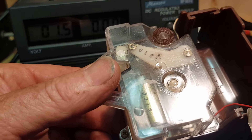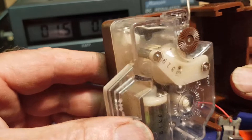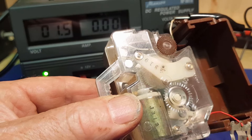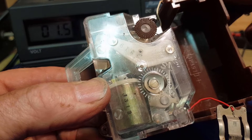This is a mechanical clock movement but it's wound by an electric motor automatically, so it must have a spring drive in there. Once it gets down and starts to lose power from the spring, something clicks the motor in and the motor winds it. You can see it's got a worm gear in there - quite a nice little movement. That's running fine; we are confident it will go when it's back in the clock.